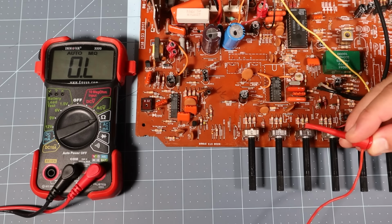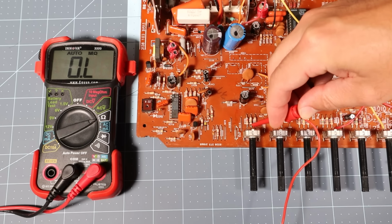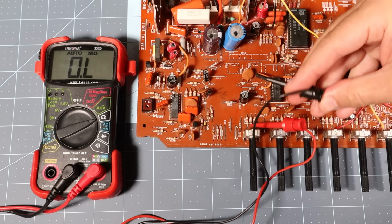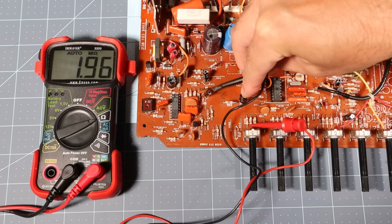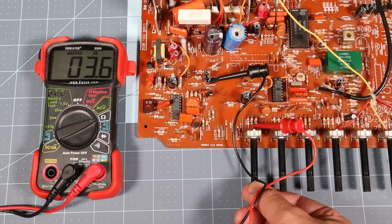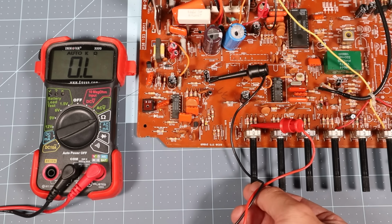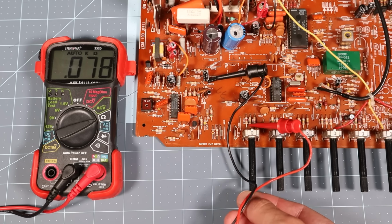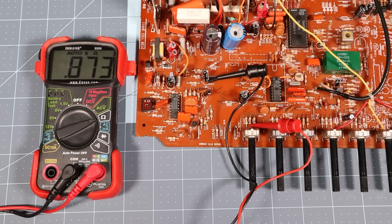Armed with a few more years of experience, let's be a bit smarter this time and perform some proper testing. First, I'll connect my multimeter up to the output of the potentiometer and see if we can vary the resistance. That's odd. It goes from roughly 0 to 2.5K to just under 1 kiloohm as I turn the knob counterclockwise from stop to stop. I would have expected a linear response. It doesn't seem right to me, but this isn't exactly a conclusive test.